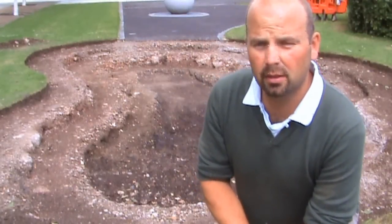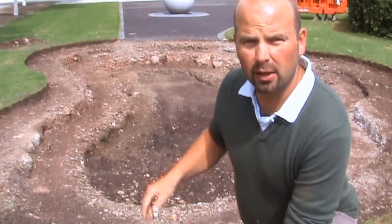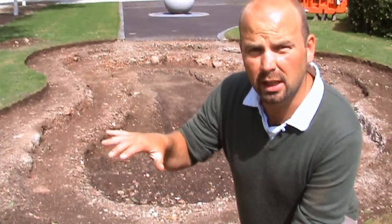That's basically it. I've removed all the big stones. All the loose sharp objects have been taken out as well or compacted into new shelves, and the shelves have been cut more or less square. It's not perfect but the ground isn't perfect either — it's horrendous ground to work with. I've added a new shelf just below me here which angles slightly back, because this end close to me is going to be cobbled a little bit like a beach, so that'll help to retain the cobbles.